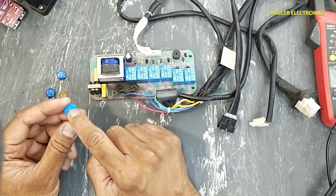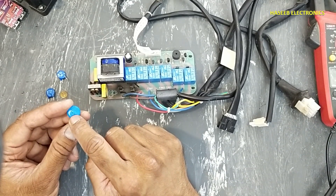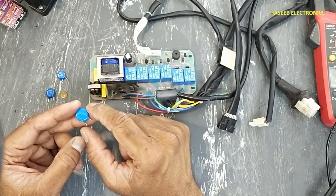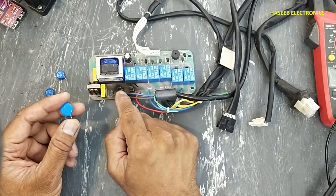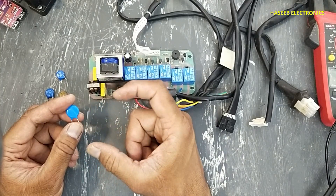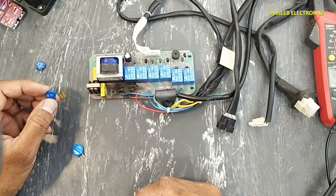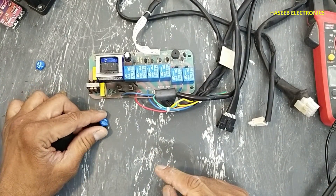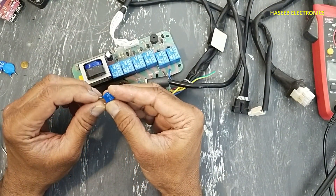I also have S14-K 471 — it is also 471 volt, but its chip size is large. It will need more energy to blast in any abnormal condition, so it might damage the next circuit because it requires a specific amount of energy to blast. I will use V10-K 300 — the same chip size and the same voltage rating. Now I will install this V10-K 300.